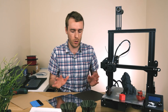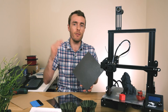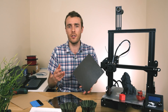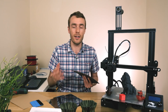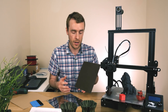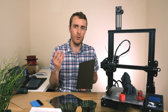At this point you might be questioning why I'm talking about magnetic flexible surfaces for an Ender 3 at all, given that the Ender 3 Pro actually comes with a removable magnetic surface. Well, magnets always have a maximum working temperature and above that a Curie temperature. The maximum working temperature is where they start to lose magnetism, and the Curie temperature is where it loses all magnetism. The Ender 3's built-in surface loses its magnetism around 80 degrees Celsius. So if you want to print ABS or anything requiring around 100 degrees C bed temperature, you won't be able to do that successfully over time. However, this sheet has been tested to 120 degrees Celsius without losing any magnetism, which opens your range of materials much wider.